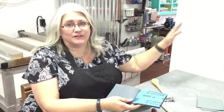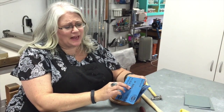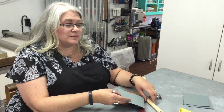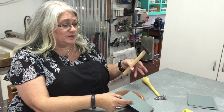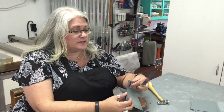If you're one of those people who don't need to have another piece of equipment in your garage or studio, that's fine. What you'll do is take higher grits of sandpaper and make your book out of those. So you'll start at 120, 200, 400, 600, and then you'll add the 800, 1200, et cetera. You'll just have a slightly thicker book with the heavier grits at the front and do exactly the same thing with the heavier grits. It'll take you a lot longer than if you had the belt sander, but it's totally, totally worth doing.